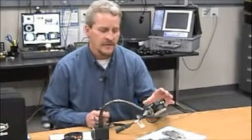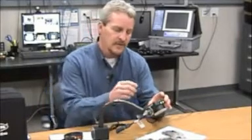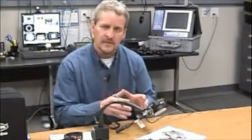It's an all-in-one camera, so there's no computer needed. It's got a touch screen on the back where I set it up and configure it. What it's doing is taking a picture of the part, and we pre-program it looking for a pattern, or we're looking for some blobs or some holes in our parts. And from there, it's going to make a decision whether it's a pass-fail.